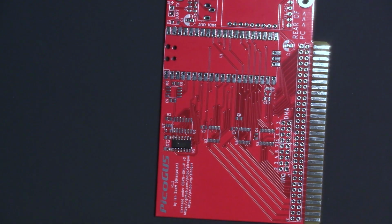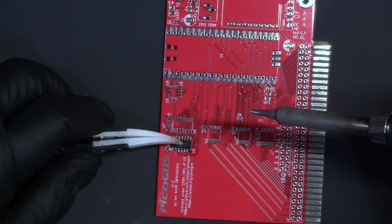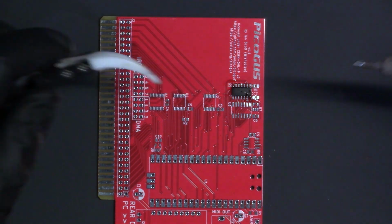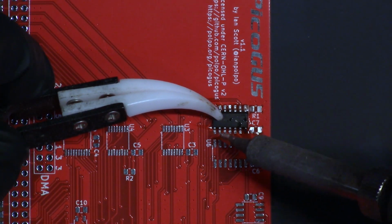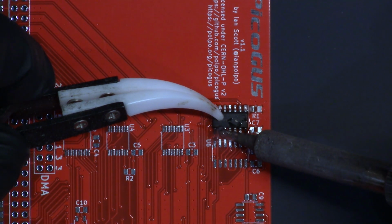When installing the parts, watch out for component orientation. The silk screen indicates pin 1 by use of a slightly longer line. The component package indicates pin 1 with a circular mark or notch. After aligning the chip, I tack opposite corners, double check that the chip didn't move, then solder the remaining pins. You might notice that I line these SOIC parts up without the use of a microscope, but I will double check alignment under the microscope once the TSSOP parts are soldered.